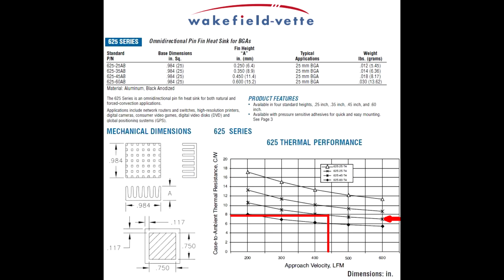per watt. 8 degrees C per watt is quite large, and we said before that we had about 17.3 watts dissipation in this thing due to the 75% efficiency at this particular input voltage. Multiply those, and that equals 138 degrees C temperature rise above ambient. If ambient's like 20 degrees, we're looking at 158, so pretty close to what we got there, even with the nominal rated airflow over this thing. Notice we measured 161 degrees C, so maybe the heatsink was slightly better than that because we were getting no airflow, but still, this is way above the maximum junction temperature of the semiconductors.